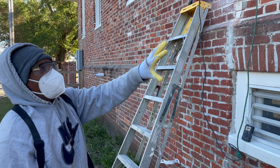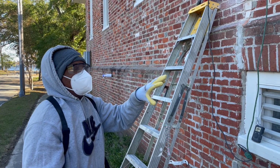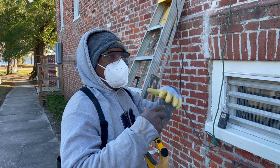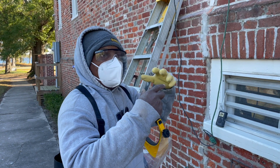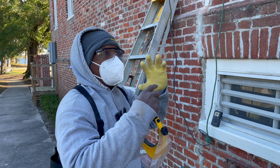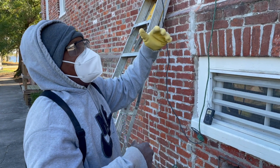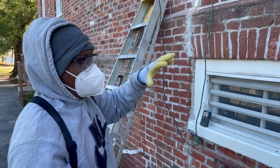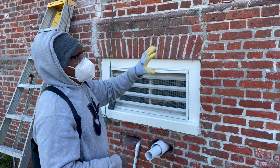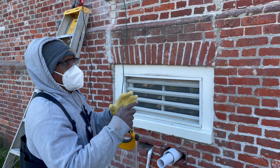Just like the lime mortar, over time, lime mortar gets harder and harder. But when you first use it, for the first 72 hours you have to keep it moist. You want it to start to cure, and it takes almost 7 days to get real hard. Then over time, lime gets stronger and stronger. You don't want it to overpower the brick, because the bricks are soft, so the lime constantly gets hard, and then it'll adjust with the brick.